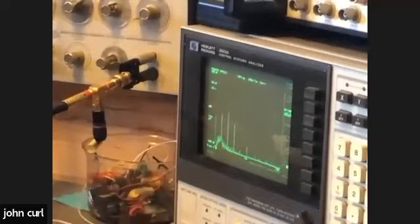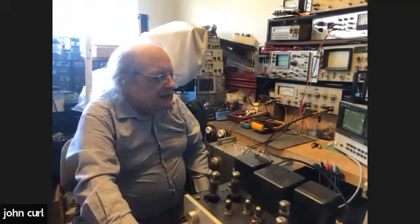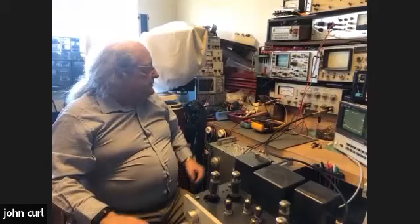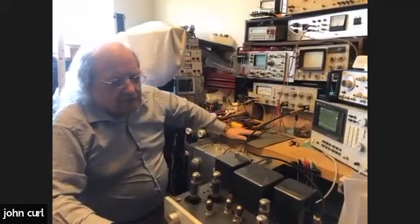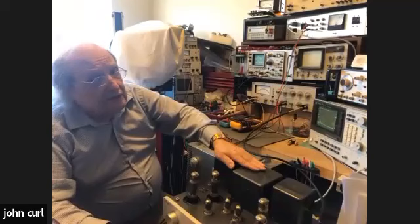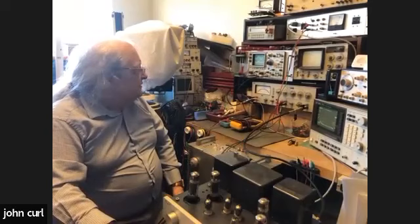The balance on the tubes is probably not exactly perfect. But it doesn't really matter that much to the human ear. The distortion is way down. The distortion is about 1/1000 of a percent. And that's pretty darn low, especially since it doesn't have any higher order stuff. So this guy's not bad for quiet listening. For higher levels, though, if you're playing a little bit of rock and roll, this thing would start to sound a little stressed. So it's not perfect.